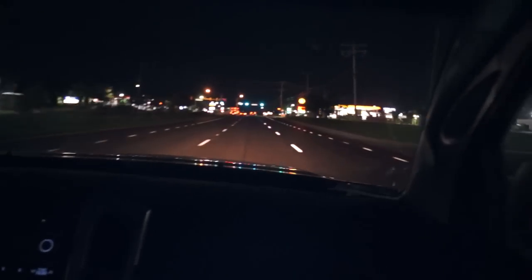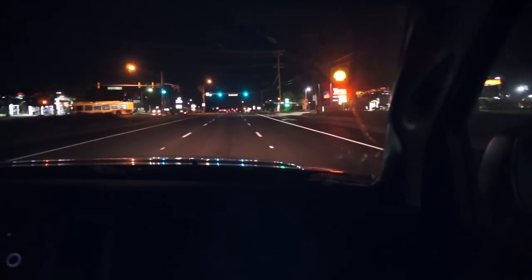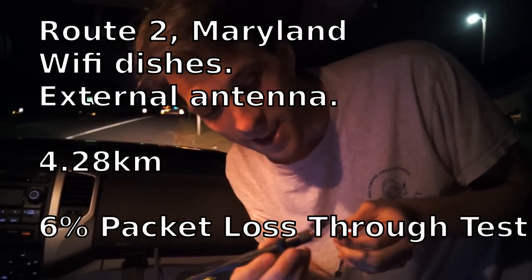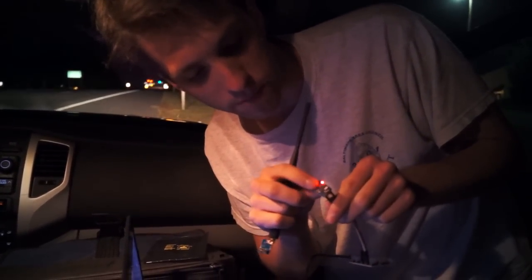Can you fiddle with the dish? The camera just overheated, but we're back. 4.1 kilometers. That was 4.2 kilometers with one of these where I hacked on the antenna — it's absolutely terrible soldering. The packet loss was 6% through the entire trip. Towards the end it was losing some, but they were hanging around 2 kilometers and still getting almost all the packets passing. So that's pretty insane. Now we're going to try it on one of these modules with the circuit board based antenna, and see how far we really get if you buy one of these straight out of box.